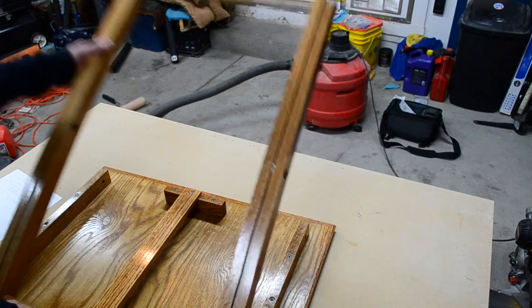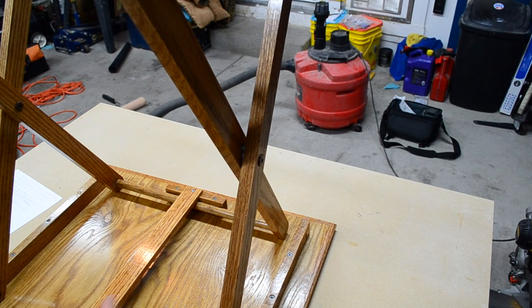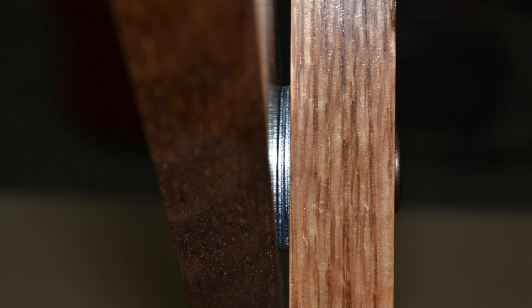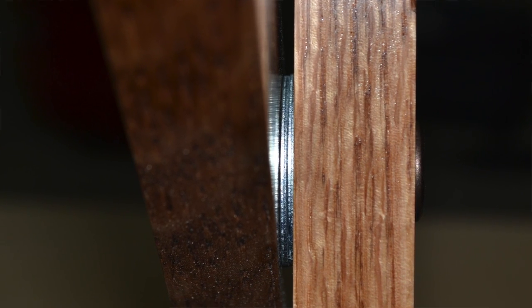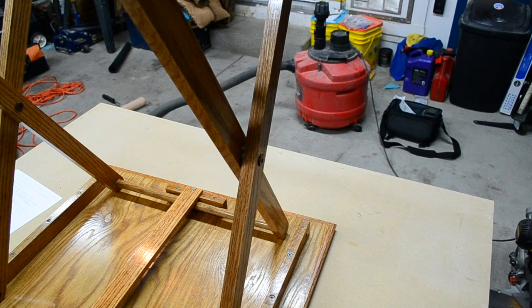In between where the bolts are, I put two washers right in between — I'll show a picture of that. At each attachment point there are two washers. That way the washers move amongst themselves instead of digging into and cutting the wood. If the washer on one side gets stuck to the leg, the other washer will still move freely because it's metal on metal. So it creates spacing and makes it easy for them to maneuver.